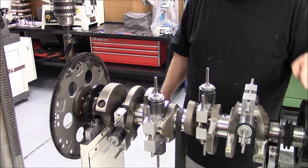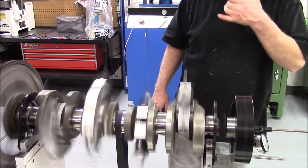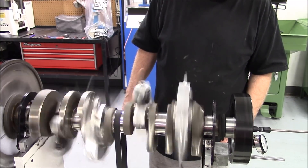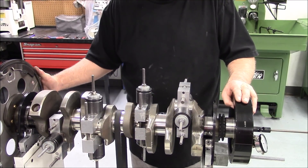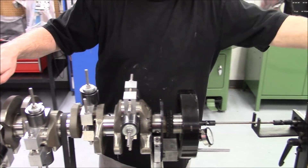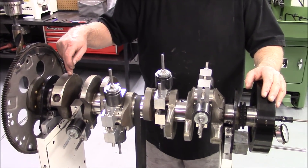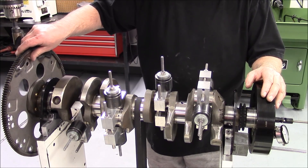We've ground here, so let's spin it and see where we're at. Now we're looking pretty good — we're at 275, the weight is dead center in this counterweight. We're down to 5.7 grams. We have not put one hole in this back counterweight yet — it's all come out of this external weight.